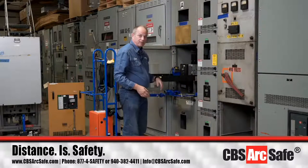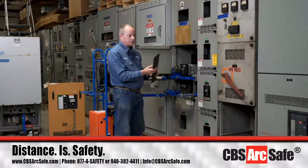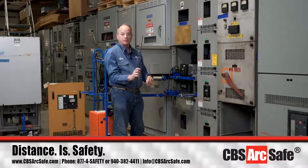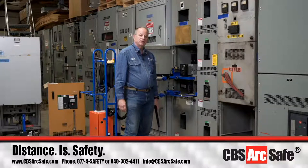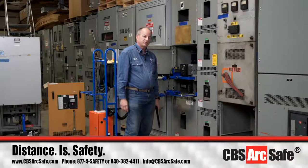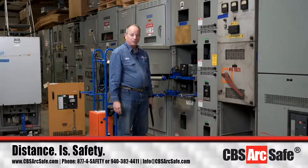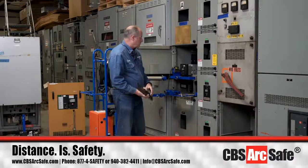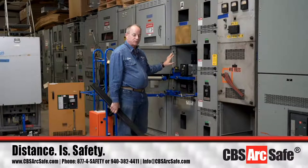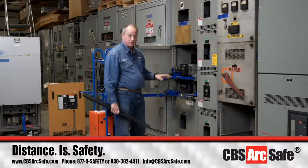One other thing to note about the DB breakers: these are set up as a replacement for the factory rails, and in the case of the DB breakers, there's normally an interlock underneath the rails that prevents the circuit breaker from moving unless the rails are in place, so you don't accidentally have the breaker fall out of the cubicle. We do make a single breaker racking device for just the DB breakers, though we won't be showing that today.